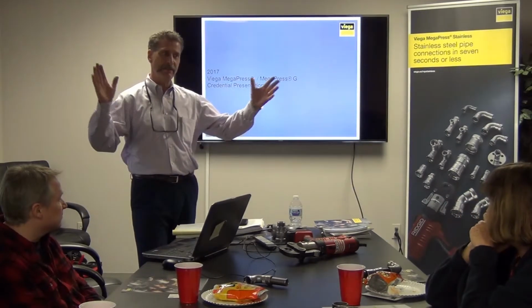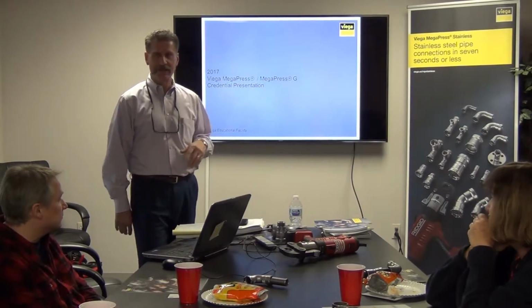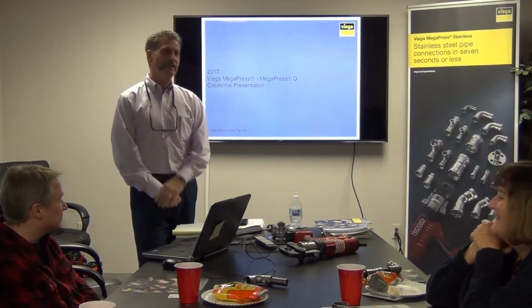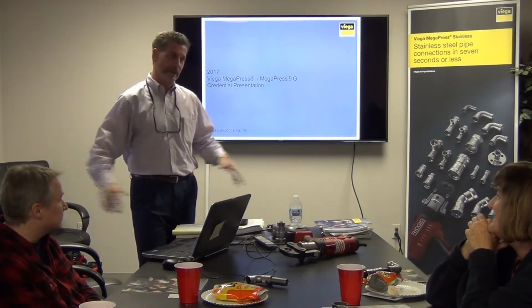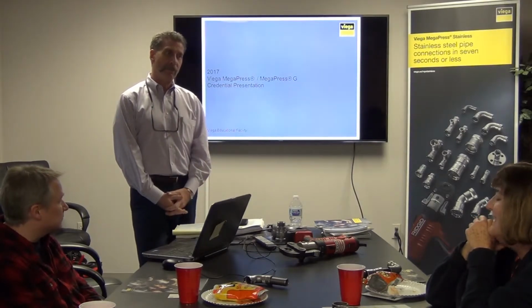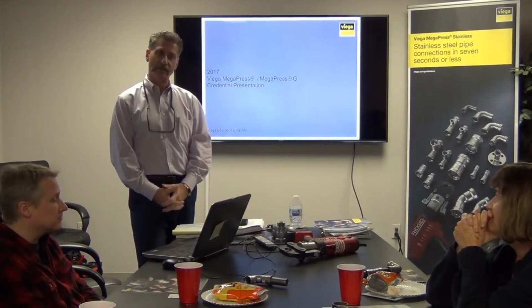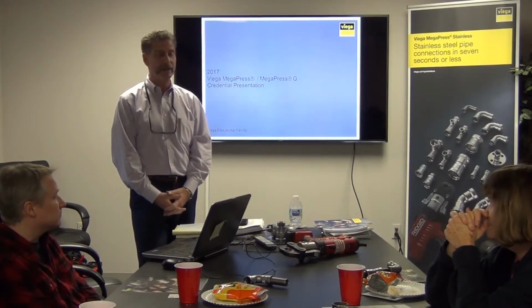It gave a false positive the day they pressure tested it, and then 2 years later they come in on a Monday morning. Why is it always a Monday morning, right? But that thing had leaked all over the place, and it was not good. So a ProPress unit like ours would always tell you before you left the job site that it's completely pressed, and if you forgot, you'll know it.